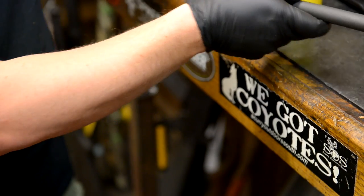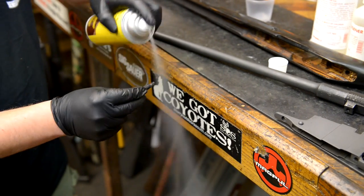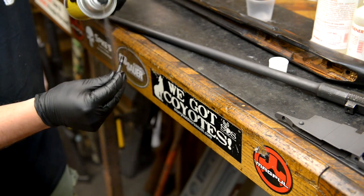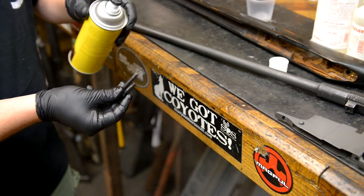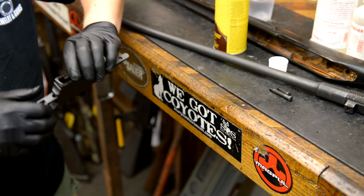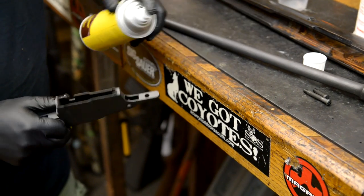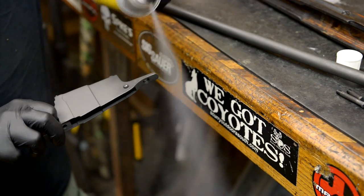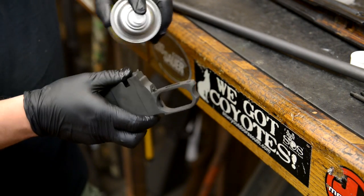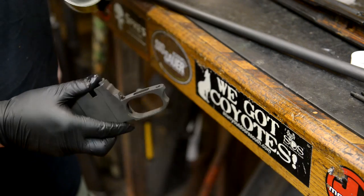That's more than enough for our purposes. We're going to do the same for the screws. The threads on the screws — make sure completely, the shaft of the screws, the threads, everything's got release agent. Because if you get a mechanical bond on this thing that you can't break loose, you're going to have a real hell of a time trying to get it to come undone. Same thing on your trigger mech, because the glass can seep through these holes.